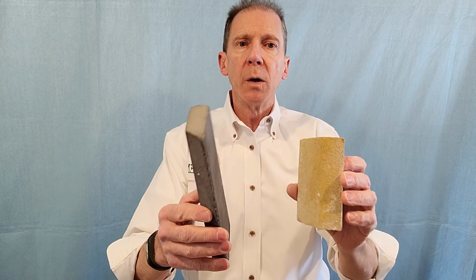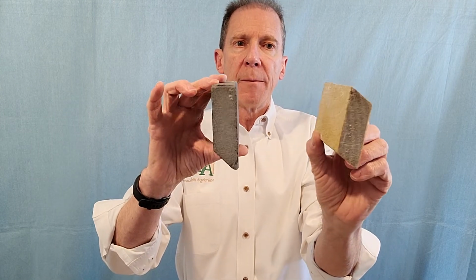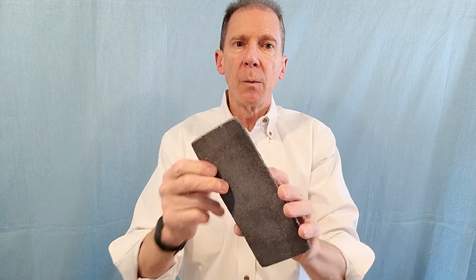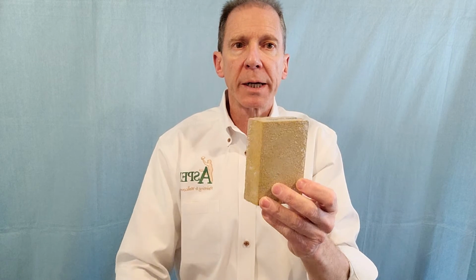Now, in addition to just regular sheets of sandpaper, we also use sanding sponges. You'll see they come in different sizes. This one here has 2 tapered ends, which enables you to get into some corners. This one just has the 1 tapered end. The larger one you'll use mostly for sanding drywall. The smaller one you'll use for also sanding drywall, but you can use this one here for prepping trim for paint as well. What's nice about the sanding sponge is that when you're sanding trim with different profiles, it conforms to the profile of the trim, which makes the sanding much more of a complete job.